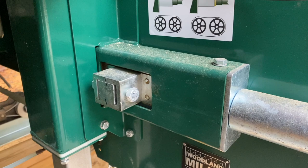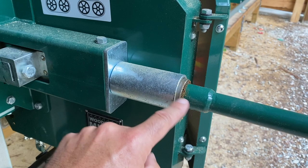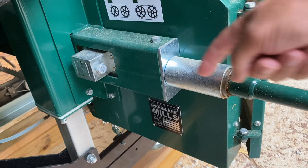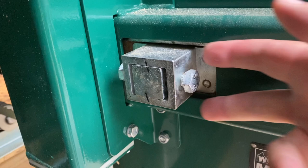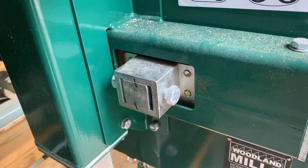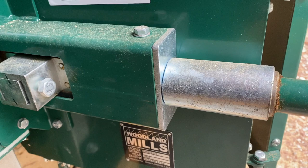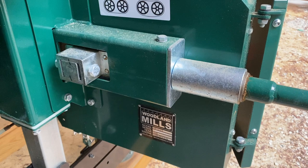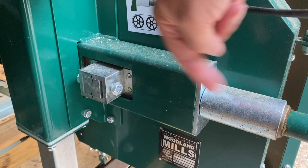There's a yoke attached to the housing with a threaded rod. That threaded rod has a coarse trapezoid thread — industry slang for that is an acme thread, commonly used in jacks and positioning systems. The rod comes through into our handle, which is drilled out and tapped to accept those threads. As I turn the handle, it draws in the acme screw and pulls the yoke and housing, moving the wheel and introducing tension into the band. This is simply a jack screw — very typical.